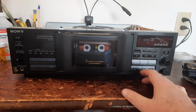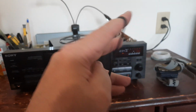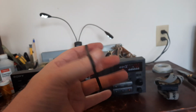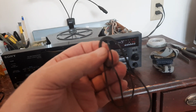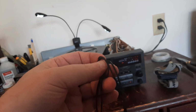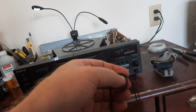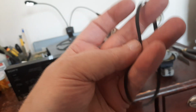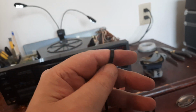Fuck. So these belts, the flat one is a flat belt, small. It's about an 8.4, 8.5 inch flat belt, small. All the rest of the belts you can get from buying a miscellaneous belt kit. So I'm not even going to bother to tell you the size of them. But at least now you don't have to blow a whole bunch of money on a belt kit. Just buy a bag of miscellaneous square belts. Okay? And an 8.4 or 8.5 inch. Probably 3 millimeters across.